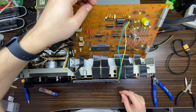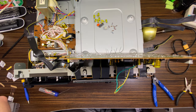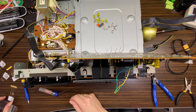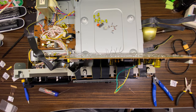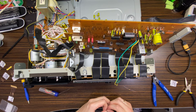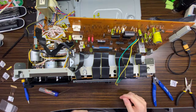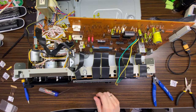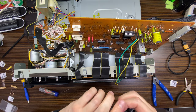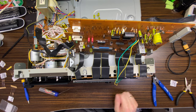Let's go further. It's R521, and R18, R19 is 220k. Okay. Let's go with 17 and 20. R17 is 4K7, it's only one. Now R20 is 270 ohms.